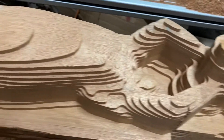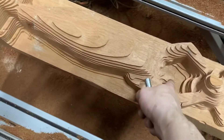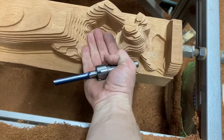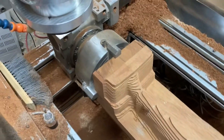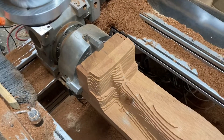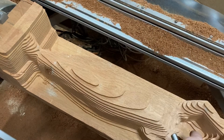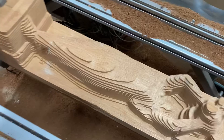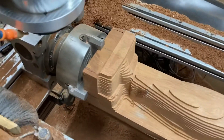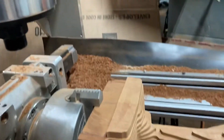So I stopped the program and adjusted my tool path. I adjusted the bottom height a little bit higher so it wouldn't go that deep for the next iteration. I also decided not to wait for it to cut all that air until it reached the bottom layer, so I tried to skip 150,000 lines of code — but I guess I didn't put it in the right spot.